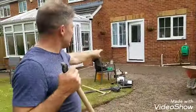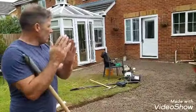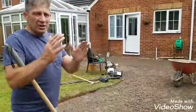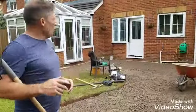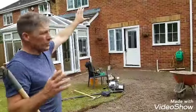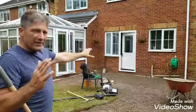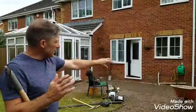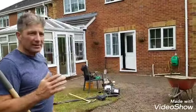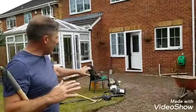What you can see around the house now is we've got some CLS timber all the way around, and that will ensure that we have a void. We never take a rigid paving system to the superstructure — the superstructure being the house. The reason for that is you'll have movement at different rates, and also what we don't realise is when it rains, a lot of that brickwork will soak up the water and at some point, at saturation levels — and we have it in the UK regularly — it's going to hit the bottom. And if you've had your paving tight to the house, you'll see all the cement sediment from the rain and the dust along the perimeter of your paving. And that's not good at all. So in this case, the water can run back down into the ground like it should do, and not capping off the area.